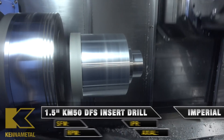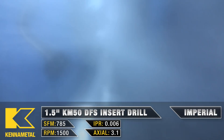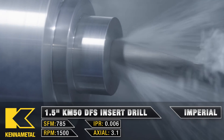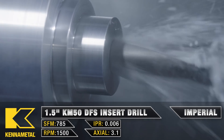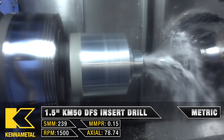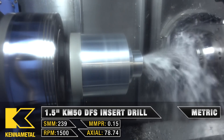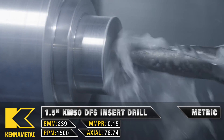For the next tool I have an inch-and-a-half DFSP insert drill. It's running at 800 SFM with a feed rate of 6 thousandths per revolution. For the first op it's going to be running like a lathe drill, but I have it in the top spindle because I'm actually going to be using it on the second side as well — we're going to be using it to do some side drilling.